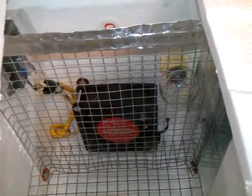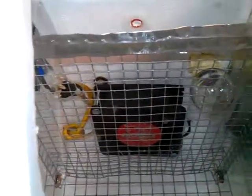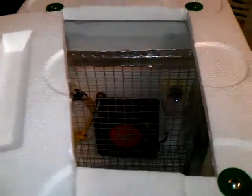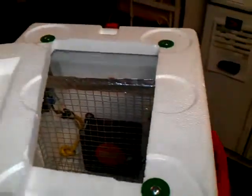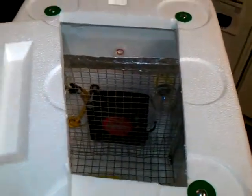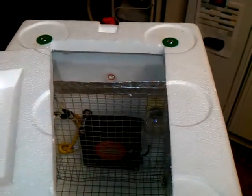And the only thing is, it's going to be a 12 volt, so you need to find some kind of like a cell phone charger or something, or some kind of a charger that's 12 volts put in there, and that way you can run your fan. It'll just have a little transformer like you do on your phones and stuff. You may even can look at some of them. Or you can just buy a little charger, like a little trickle charger, and probably run it.